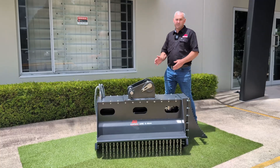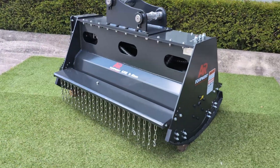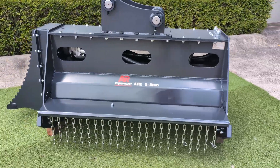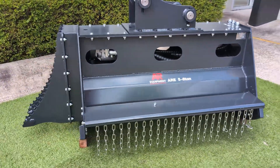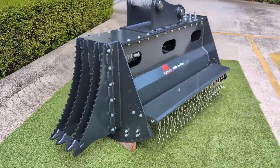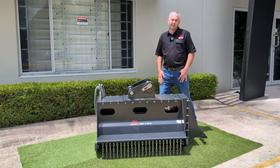These run a case drain, so you do need to have a case drain set up on your machine — it's very critical. But other than that, easy to set up. All your hydraulics are contained inside the body on these, unlike some competitors where they're out the side or back and can get knocked around. It's a very tidy unit. Go really well — get yourself one today.